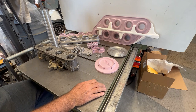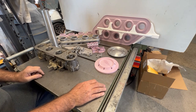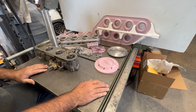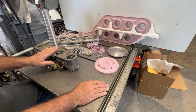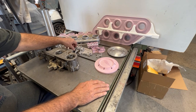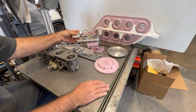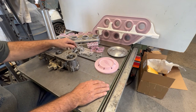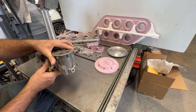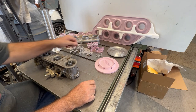This is just a sampling of some of the things I was working on during that time. I'm kind of fond of inline carbs and make a lot of parts for them — you can probably remember the four-part series on the intake manifold. Part of the project was a bunch of little pieces, some for the linkage in that system. These are bell crank arms that I made a few of, and I also machined idle stop arms for each end of the carburetor. You can see the pattern with the tree structure for them and all the finished little machined parts.